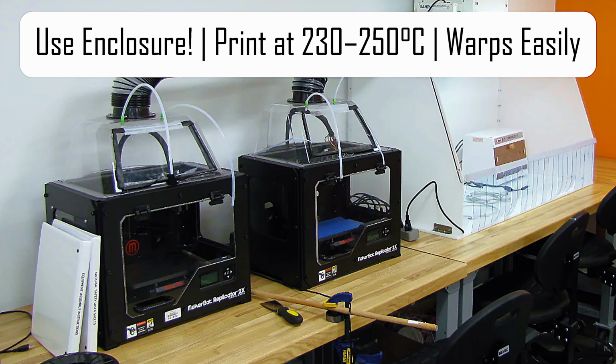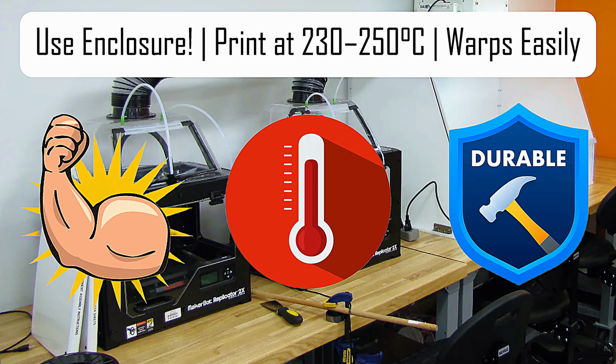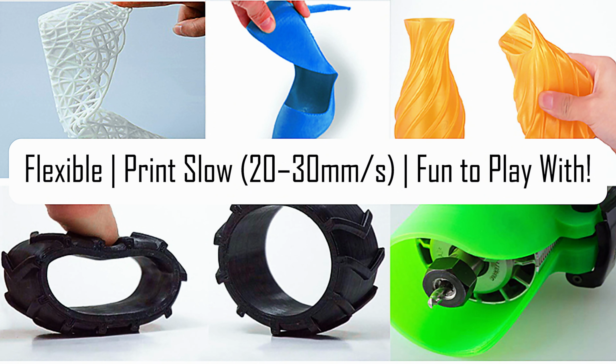Now ABS. Strong, durable, and heat resistant. It's used for real-world parts like automotive components. But here's the catch. It warps easily and gives off fumes, so you'll need a heated bed and ideally an enclosure. Last but not least, TPU, the flexible stuff.